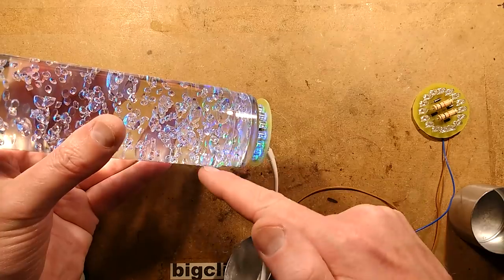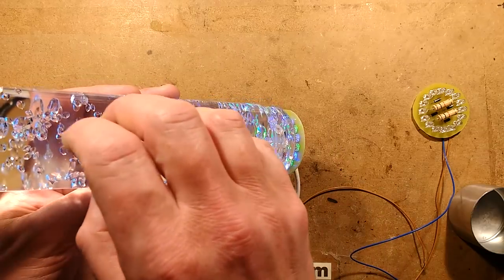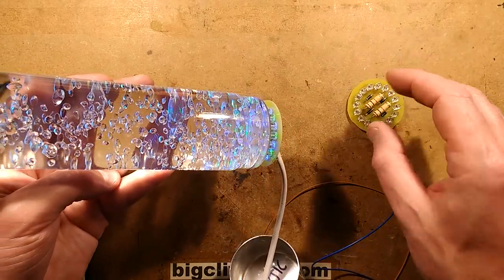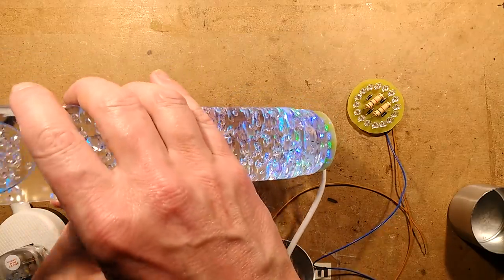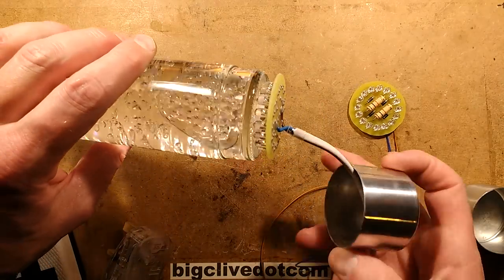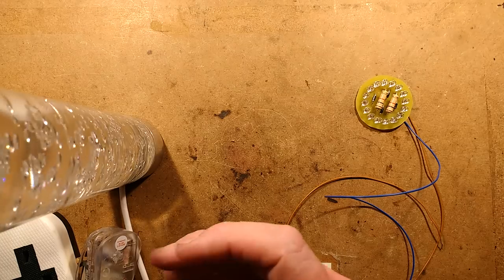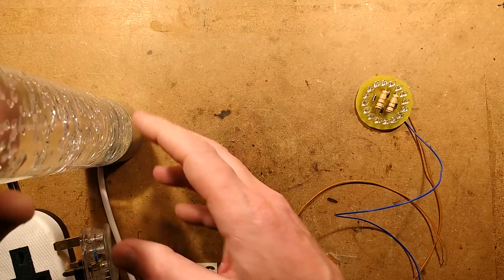This is a good result — it looks very very nice. I put the LEDs alternately green, blue, green, blue on this one. Let's take the cover off and power it up — you can see the green and blue vividly at the bottom, but then it goes up to just a turquoise cyan colour because the colours mix as all the beams from the LEDs merge. It'll be interesting to see what this one looks like with the other segments of colour. But it's a good project — very compact, much more compact than a traditional glitter lamp, and the movement once you've got it balanced is actually pretty impressive for such a low power. With the unity power factor and power consumption of about 2.5 watts, it's one of these things you could just leave running all year, 24/7. The LEDs are run at just 10 milliamps, which will result in much longer LED life — still amply bright enough for the visual effect.